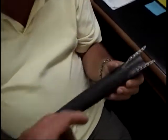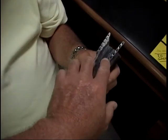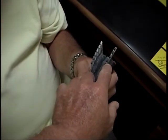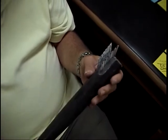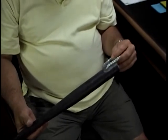You know, this is a hit and miss thing. What you gotta do is obviously, when you make the real pipe that's going in the plane, we gotta know where this gets too restrictive. And that'll be easy to figure out. You just fill them with JB Weld for a test. You can do that right on a test bench. I want to hear what it sounds like, too.